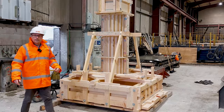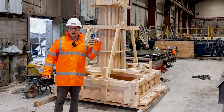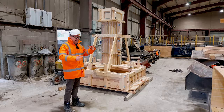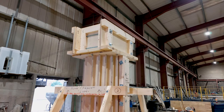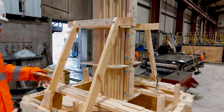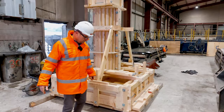We've seen the rebar form that's been put together by our guys in the rebar yard to make the structure for this bespoke item. It's been specially designed for our client. That rebar skeleton will be going inside of this specially made mold. The mold is made of very high-grade ply and is detachable in various sections for ease of installing the actual framework itself, and for building up and putting the concrete in at various stages for this bespoke structure.